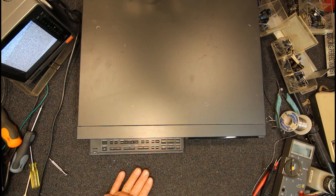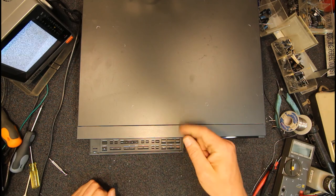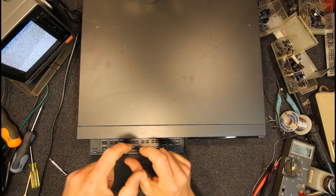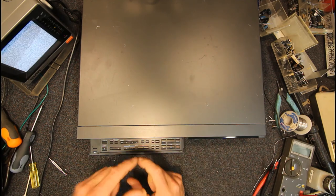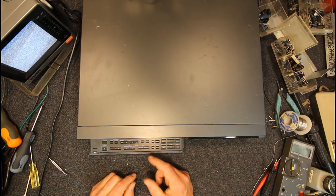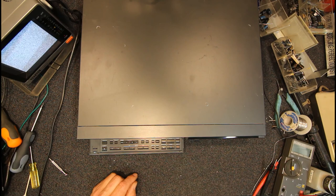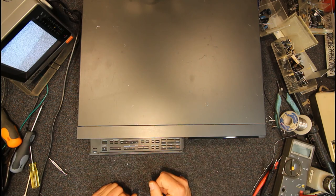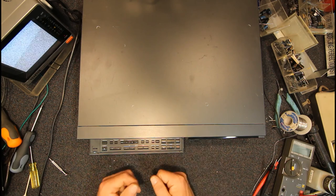But you get the mechanism in the right position, so there's a little hole in that mode switch. I think the wheel and the black plastic under it. There's a hole in the white wheel, the tooth wheel, and there's some sort of marked little V notch in the base bit. You just got to get them lined up before you take the mode switch out. Then you can just pop the top off it.